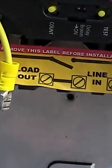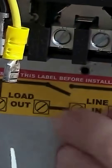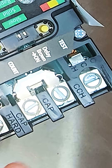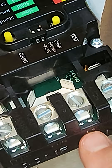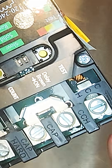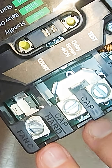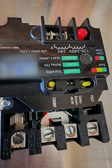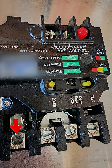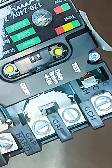If you remove this label — which I would just stick near the contactor after you've installed it, or on the data tag — you can see it really describes every single thing. First you have L1 which is shunted, so those two terminals are really the same. You have the other side of high voltage coming in, and then you have your two load sides — one being shunted and one to the opposite side — and it gives you additional guidance on what you can connect to each side.